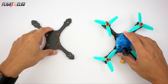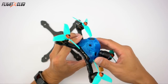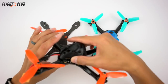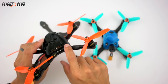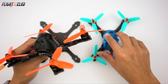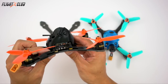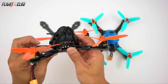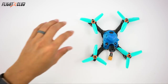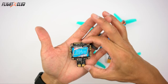The Phuket is designed to be used with a single stack all-in-one. It can use a double stack with say a four-in-one and a flight controller, but you'll just have to use 20 millimeter standoffs instead of the 10 that comes with the Phuket. As you can see here, I've got an ESC with flight controller — it's a double stack — and I just have to use slightly longer standoffs to raise the canopy to give room for the stack.